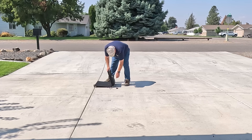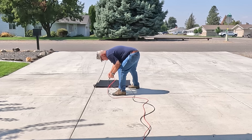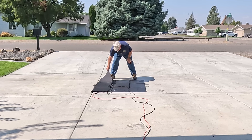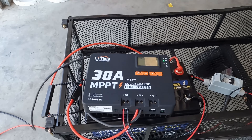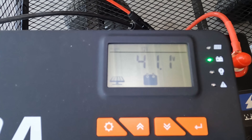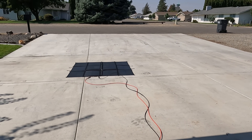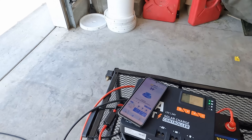I'm going to connect these up on the ground because I'm going to flip this panel open. This whole panel folds up really nicely — it comes with little loops you can hang it on something, and it's got a zipper right in the middle so you can separate it if you want. We're going to go to the solar panel setting, flip the switch, and look at that — the voltage is coming up to 41 volts. Battery's at 13.2, we're charging. We've got 278 watts coming in from the panels just laying flat on the ground. The app is showing 275 watts going into the battery.